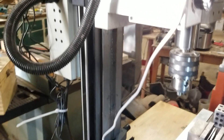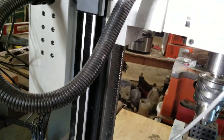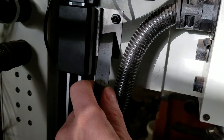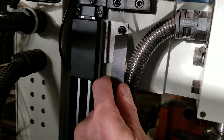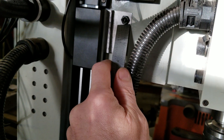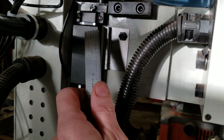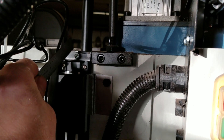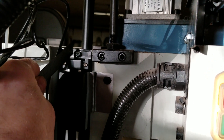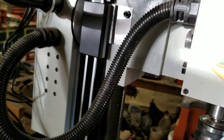We'll start with the easiest one, which was the Z-axis. Pardon the sunshine glaring through my window, but you can see I mounted it straight up and down — pretty simple. This is the simplest one. I did have to make a bracket to attach the slider to. I just used the original spot where the pointer for the ruler was mounted, made this bracket out of sheet metal, attached it to the slider, and tapped it 8-32 for machine screws. That was pretty straightforward and worked excellent.